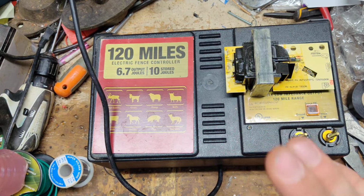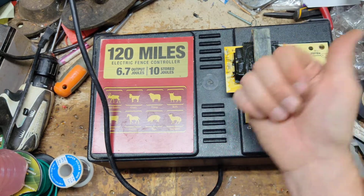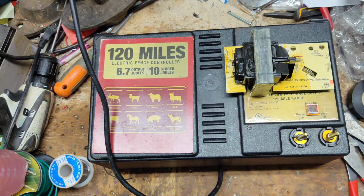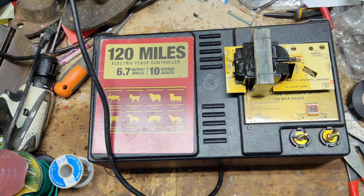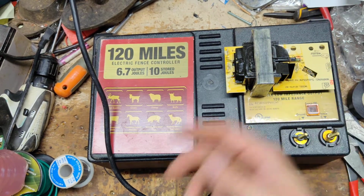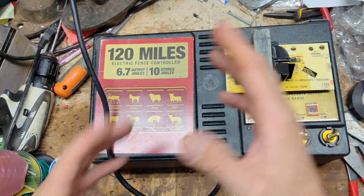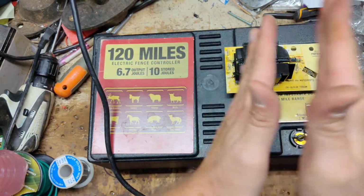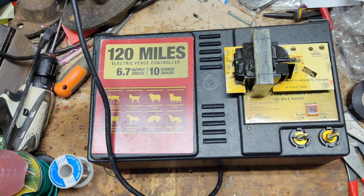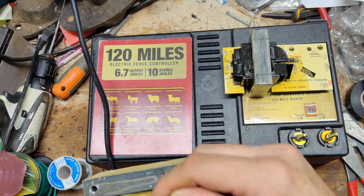But some models that don't have that adaptive control, like a Gallagher M800, a Cyclops Champ, or a Power Wizard PW6000, or pick another brand of the mid-size units, will use a multi-stage or multi-core transformer that has multiple layers inside to dissipate the heat. I'm trying to see if I have a transformer like that. Give me just a second to go take a peek here. This is kind of an exaggerated version, but I'll show you what it is.